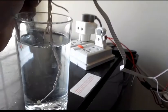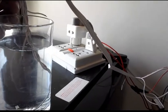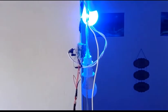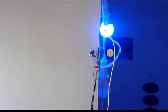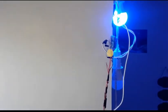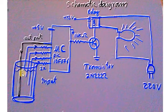This is a microcontroller-based water level indicator. We have used the PIC16F676 microcontroller. Next we will explain the C codes and the schematic diagram. The schematic shows a glass of water — a water tank — in which there are four wires. One wire is used as output to supply positive voltage to the water.